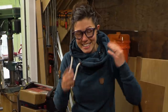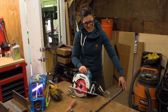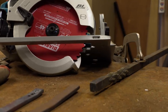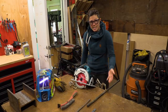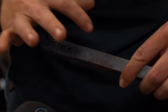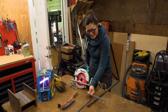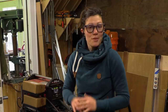First things first, I've got my safety gear on. I have a half-inch square bar that I've created a beautiful little pineapple twist in. We're going to cut it down to length, squish it out in the forge, and poke a hole in it to make a nail header. As a backup option, I've also crudely created some little square punches. We're going to weld this onto here and have two options for nail heading — we'll just see how it goes.